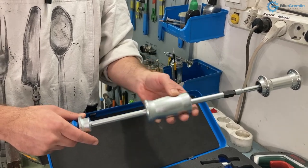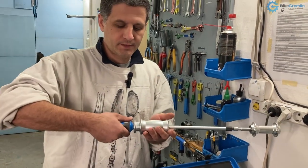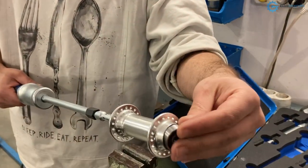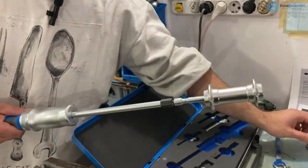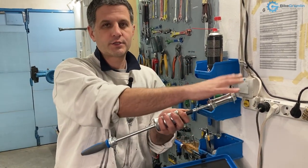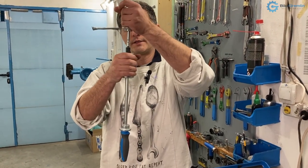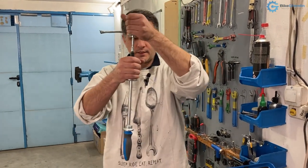I slide this back and it hits this part, giving me the pulling force - I'm using speed and the weight of this hammer. If the part you are working on is attached to a stand, you can use both hands to keep the tool level, because you don't want to pull at an angle as it might damage the interface. You want to pull as close to straight and parallel as possible. If the part is not attached to anything, I like to just use gravity - hold the part and use force to quickly pull this down and hit it. In two or three hits it should come out.